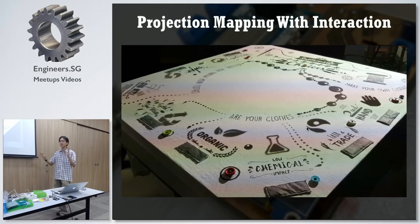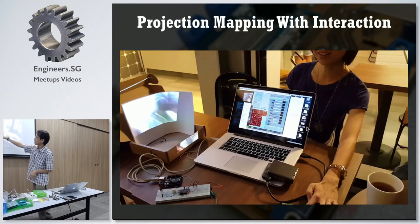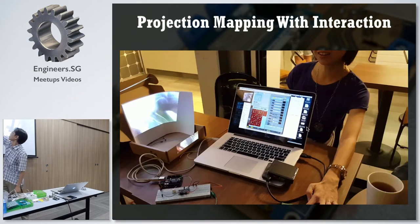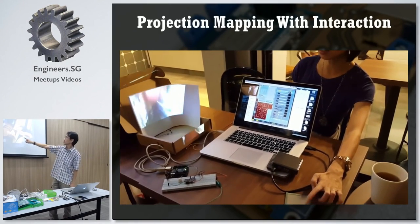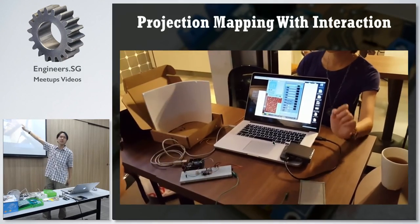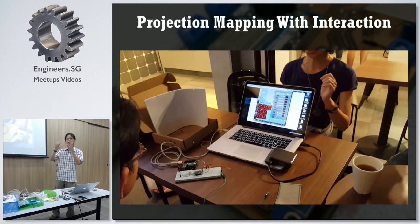So this was a project that I did together with Linus. It's more like an arts, technological, artistic project — part art, part technology, part design together. How it actually works: here is the Arduino. This little board is what you call a capacitive touch sensing board, which is the same board you see here. This goes into the MacBook, which is running a software, and this is a mini projector. So when you touch it, the Arduino sends the signal into the computer, which changes the projection. It's actually two different systems working together — you need a computer which does the projection, and an Arduino which controls the interaction with the person.